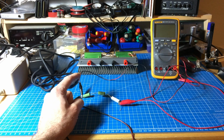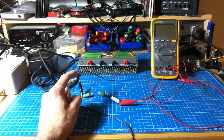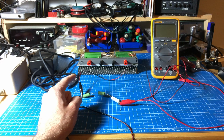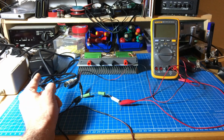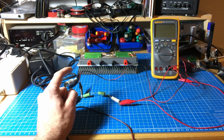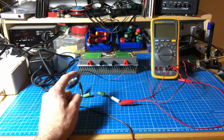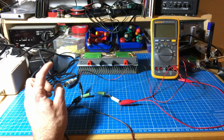Yeah, so this is an 8 ohm load which will pull some watts out of the 5-volt line. To get the whole 1 amp that is in the specs, you would have to use a 5 ohm resistor, but I only had this 8 ohm resistor, which is probably close enough, I would say.